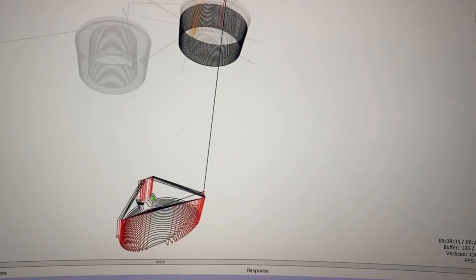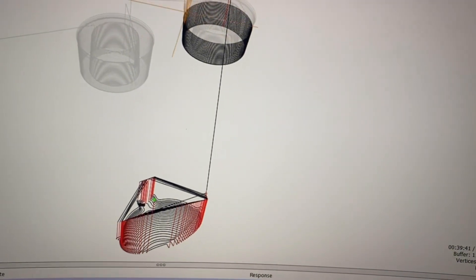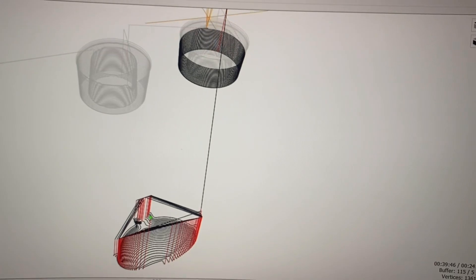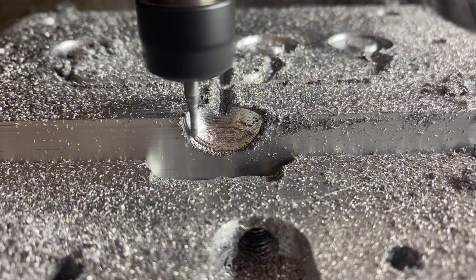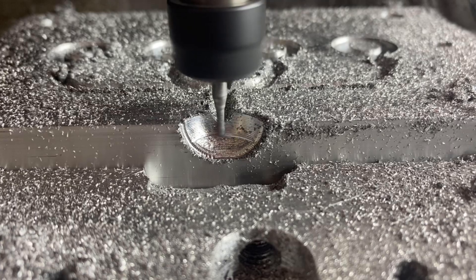That's a good reason to hang around your mill when you're milling. If you hear the bit or the mill loading up unnaturally, you can immediately slow down, pause, or abort instead of coming back to a broken bit. You can see that little groove left in the bottom because I didn't face the bottom of the pocket before I did the ramp — hence the reason I had to slow down the bit to finish off that groove.